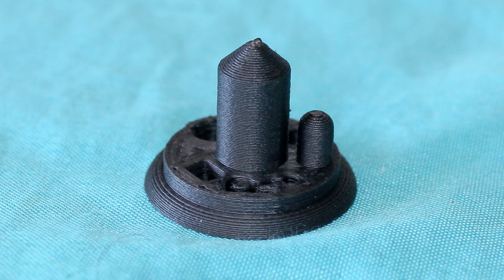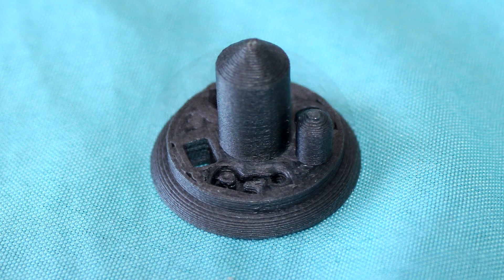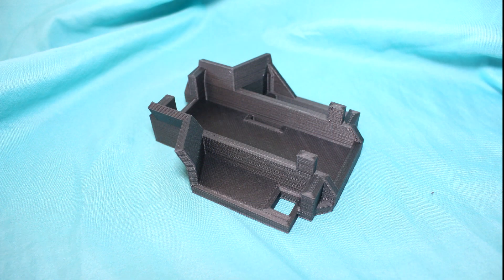So this was our first test print. We just ran our standard PLA settings with the temperature pumped up 5 degrees. It came out fairly nice but as you can see on the top layer there were some gaps in the walls, so we ended up having to bump the extrusion rate up a little bit. Our final extrusion rate ended up going quite high to get those walls filled in — about 130%, which seems quite high. I don't know if that's to do with the 0.6 nozzle, but we had also changed it in Cura to match.